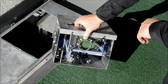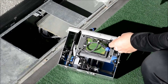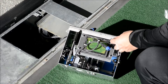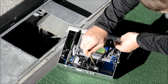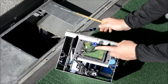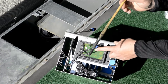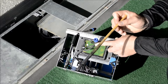Part of our monthly maintenance with the ball engine is to grease the main lead screw and the injector rods next to it. Only use our LMX grease that we provide — if you run out, contact us and we'll send you some more. Don't use anything other than our LMX grease. We use the paint brush provided, get a small amount of grease, pop it on the main lead screw and the two injector rods. Once connected, press the new ball button — as it travels up the main lead screw, put a little bit of grease underneath and on the injector rods and it pretty much self-greases. That needs doing once a month. If you've got a build up of grease or dirt, clear it off first before you put your new grease on.